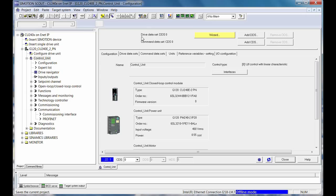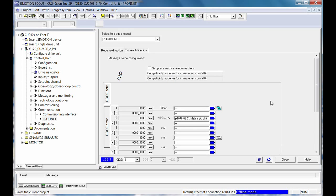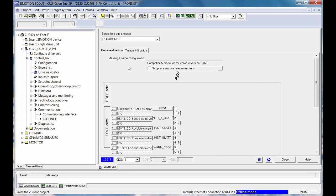I'm going to show the Ethernet IP drive side configuration. Once you commission the drive like you normally would, all you have to do is go to the Profinet settings, select six words in, six words out, which is Telegram 352. That will automatically program the drives for the words going and coming, the status going and coming.